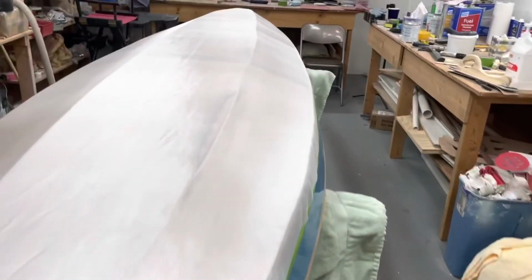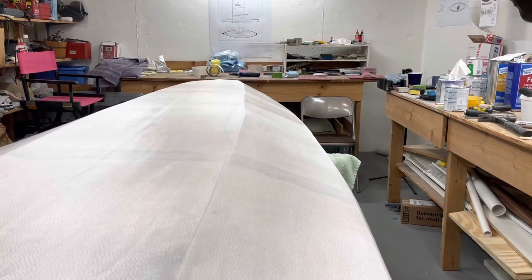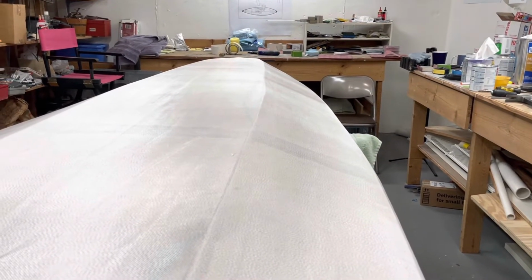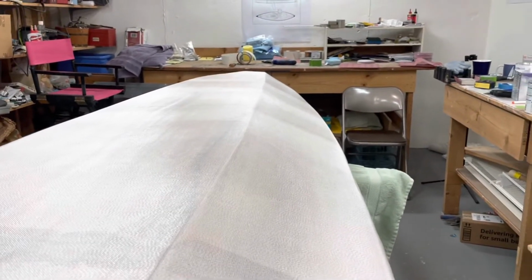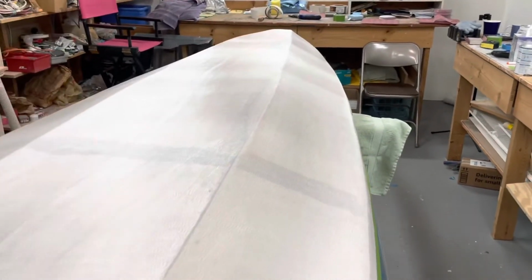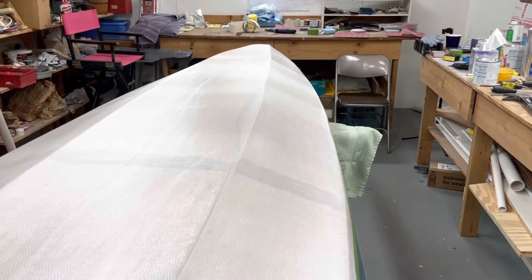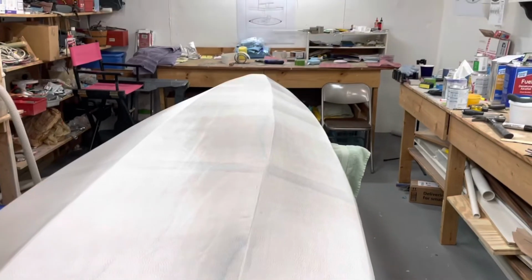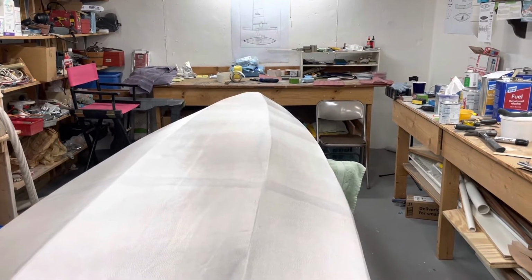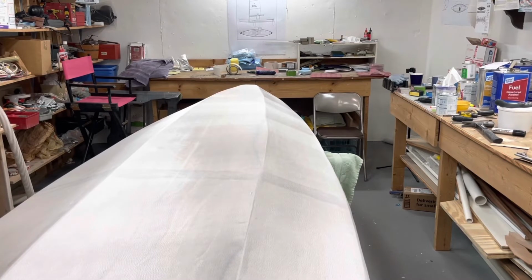I wanted to show you here where I've got a little bit of wiggle in the hull, and I think you can see it here in this picture. It's especially obvious on the port side here. And I'm not quite sure why I have these wrinkles in the hull, and this is not in the fiberglass, this is actually in the wood. I think part of the problem may be that I didn't stitch it evenly enough or pulled it too tight a little bit prematurely. I'm not sure. Maybe the edges of the panels needed to be worked on just a little bit. But as I said before, I've been trying to get this to even out. I'll probably do some fairing after I get the fiberglass finished with some compound, but again, only the fish can see it.